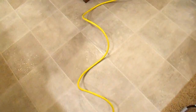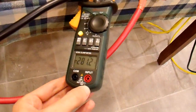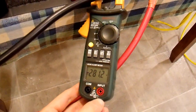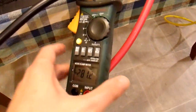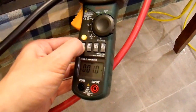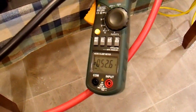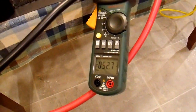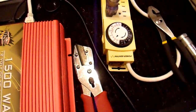Let's run upstairs and take a look at that clamp meter. Back upstairs - it's plugged into the inverter and it's running off of the inverter. If I take a look at the clamp meter, the maximum reading is 280 amps, which is fairly impressive really. That's almost a 3000 watt surge - or at least the inverter took about 3000 watts of power. So it'll probably output 2500 or so. If I turn the max-min off, it actually takes about 600 watts to run that thing, and that's about right. It's inputting 12 to 13 volts right now because it's plugged into a charger. I'll test the efficiency later. Pretty decent. So I'll shut off the dehumidifier.